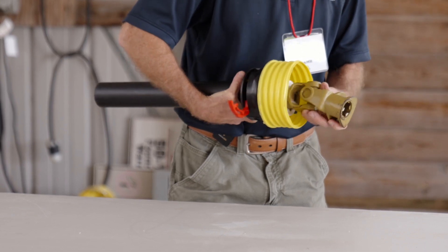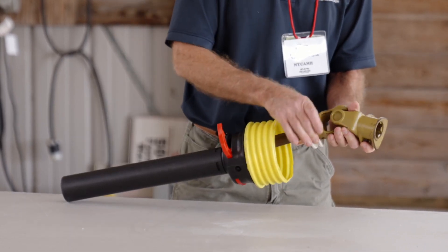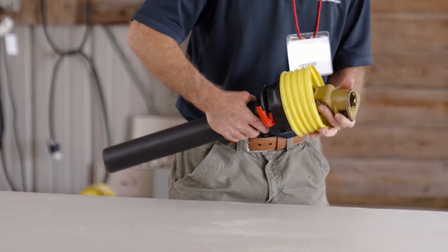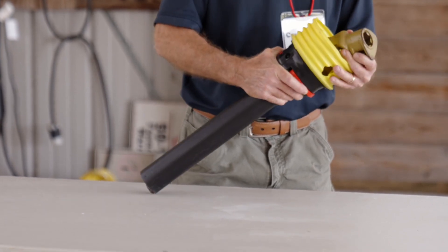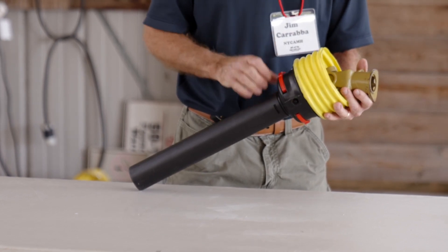You'll have a shield that goes over the universal joint. There's a bearing in the bearing groove, so this shield slides up onto that bearing. The Bearco replacement shields have locking levers which hold it in place on the bearing — that's a really good feature of these.